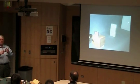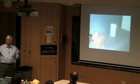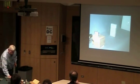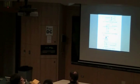And compared to a normal shutter, about the only thing we had to add was the latch. No motor, no encoder, no junk that you would normally have to work a screw thread lens. Furthermore, they were all the same power, didn't have to be adjusted in assembly. They just were molded right and they went together.